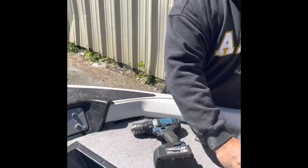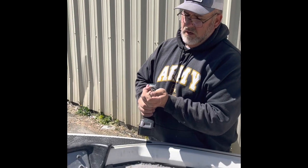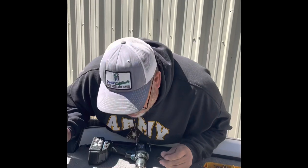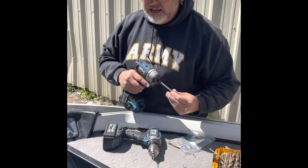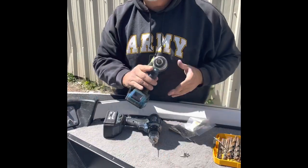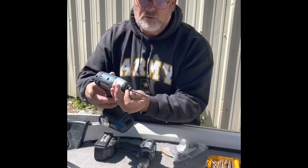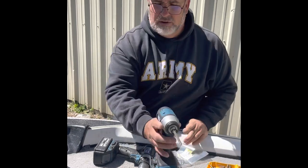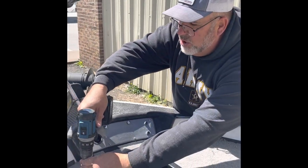Let's go ahead and size up a drill bit for this to get a good starter hole going. We got the first one drilled out. Now there is almost no play in this — we cut that super, super tight, which is great, but we always have plenty of room. These are stainless steel screws but they're still fragile, so I don't want to just bear down on this. I want to make sure I drill it out so I get a good bite. If I just drive it without pre-drilling, I run the risk of actually breaking a head off, and then I'd have to go through an extraction process — and I don't want to redo this. Now that we've got one in, everything's tight, so I'm going to go ahead and pre-drill all the holes.